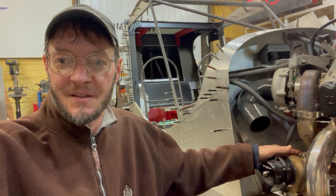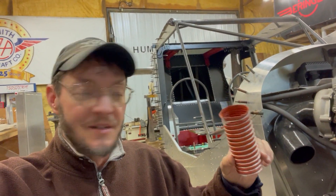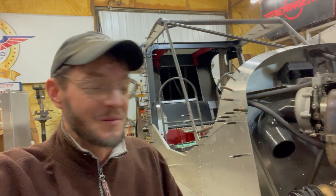I have a completely off-the-wall crazy idea that I think could potentially work for cabin heating in this airplane. It's still going to use the same heater muff off the stainless exhaust collector. I'll essentially have a duct toward the front of the cowl that comes back across the exhaust collector, comes out the opposite side, and then the hot air will be ducted into the cabin through a piece of flexible scat tube. It's going to jump into a whole other modification and I'm not going to tell you guys yet — I'll show you when I get closer. I have high hopes it's going to work. Anyway, no real progress to show today; the progress has been in my head — thinking, brainstorming, trying to come up with a way to make this work.